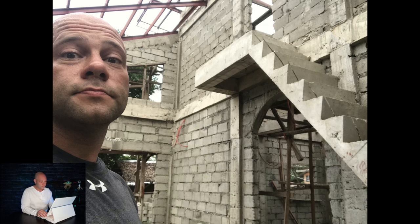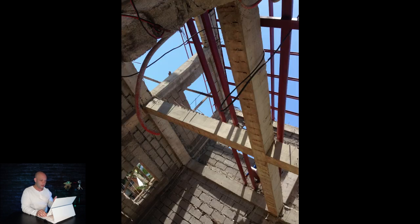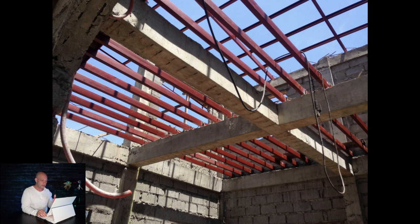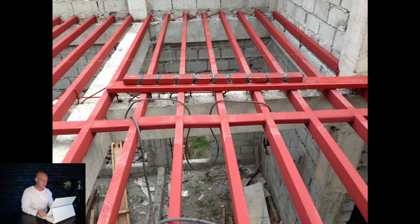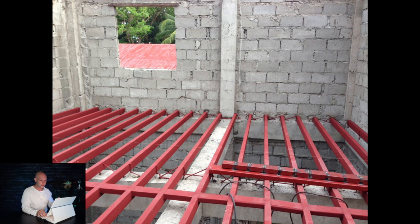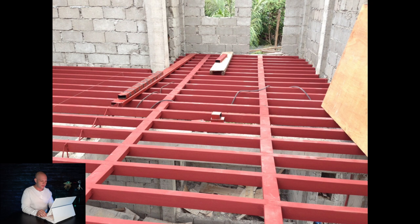There's the post, and here they're doing the second floor — taking all the beams laid across, installing the metal beams, and welding each one to the rebar sticking out of the cement. It goes from one end of the room to the other, gets welded in the middle, and on each side — it's very strong. My OCD is kicking in regarding one little bent piece, but that's okay, not a big deal. After everything was welded into place, they ground it and painted it. It looks much better now — that's a strong, well-built floor. Definitely worth investing the money in metal versus going with wood.